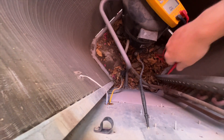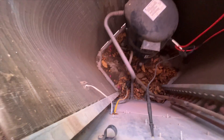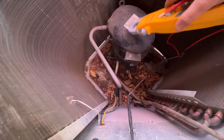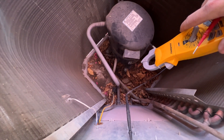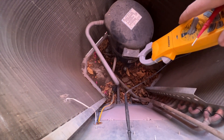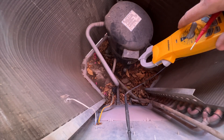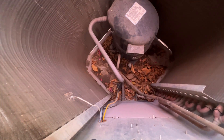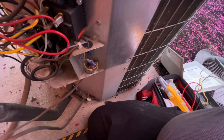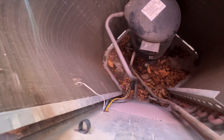This compressor's toast. I've got this open here — I'm going to get the model number off of it. Because it's an older compressor, it might be a retrofit where we convert it over to a scroll, which really sucks, but I might have to deal with that. We're going to get that information and go from there.